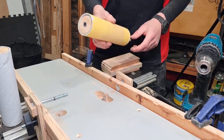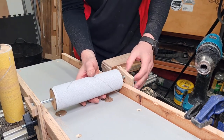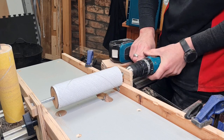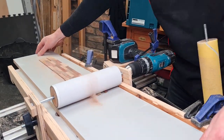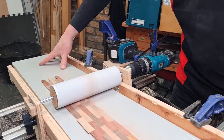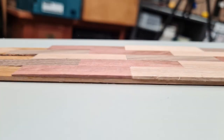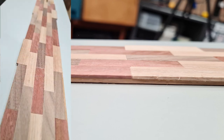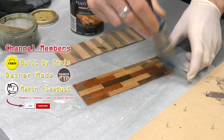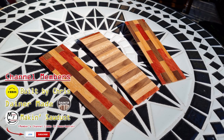Once I'd taken it most of the way down with the 60 grit roller it's just a few seconds to change that over to the 180 grit roller. And if anything this one was even less centered than my last one. Really this is just a prototype — I can envisage a version 2 where, once I have a drill press to drill my holes a lot more accurately and do a custom design instead of converting my router sled, this has a lot of potential to be an actual useful tool for the workshop in a general sanding sense. For now it is really just a thicknesser, and there are my results — I was able to get down to about a millimeter to a millimeter and a half and really even out those pieces of wood. I'd like to thank my channel members as usual, and if you enjoy this sort of content please do subscribe to Fix It Fingers and I will see you on the next one.